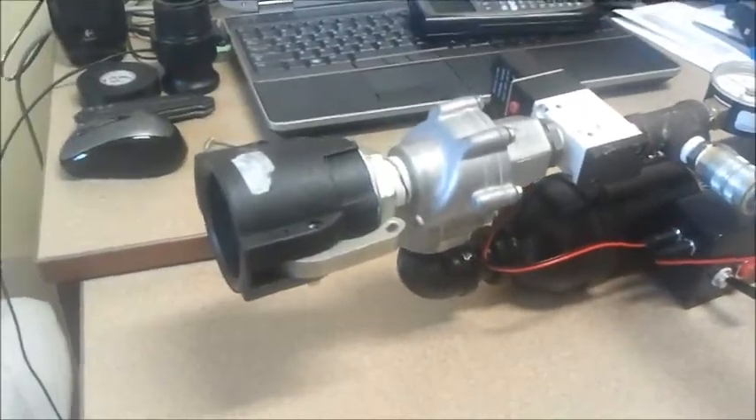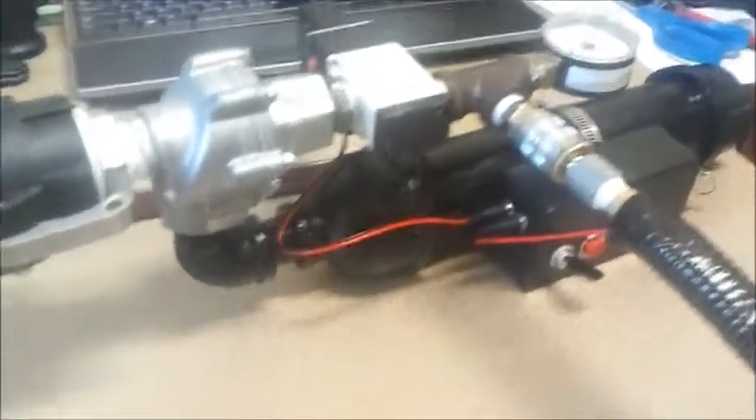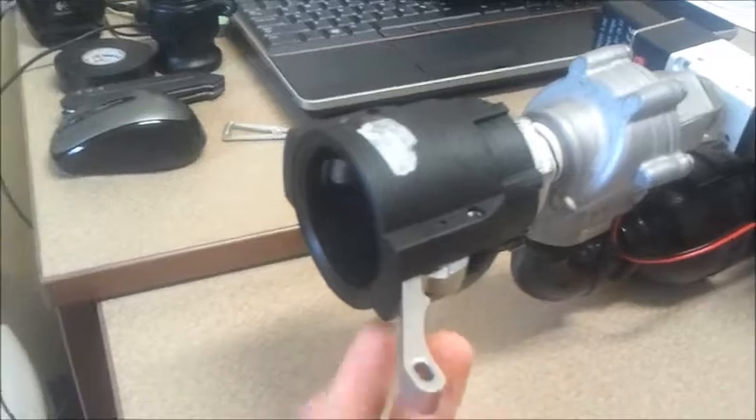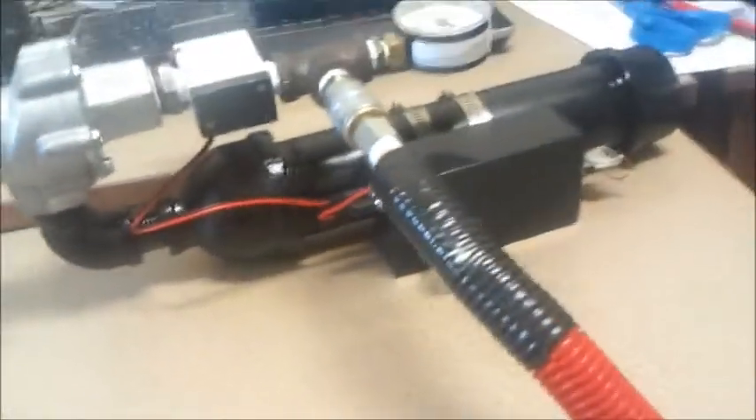The only problem is you're limited by the way you load. With the barrels I have here — this is a quick one I threw together — you can see the male cam lock fitting and it goes through there. That's 3/4 inch schedule 40 PVC. I use that for Nerf darts for plinking, just shooting around. I also have a 1-inch barrel for potatoes. Those just go in here — this is the locking fitting, a button on the bottom, you can hear it lock. It's quick and easy to change out the barrels — it's a really nice feature.